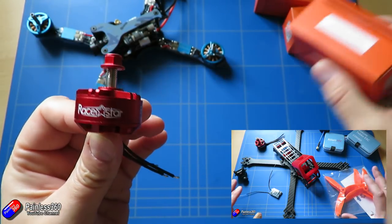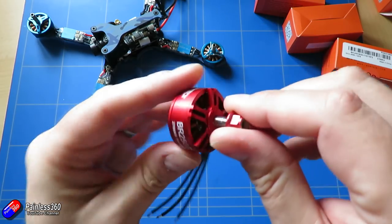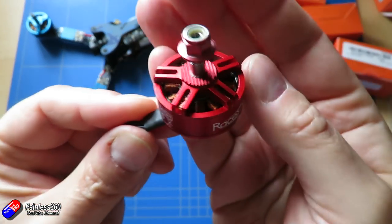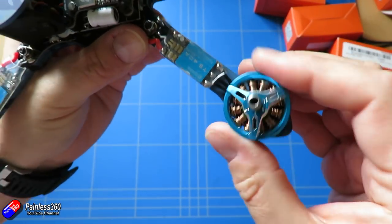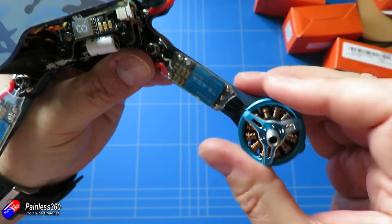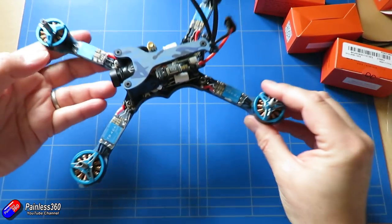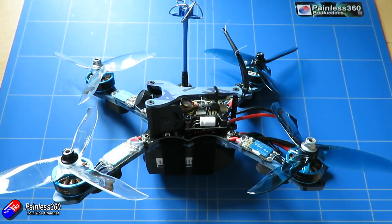A lot of these motors are very open, so be aware of that when flying in particularly gritty or crappy conditions. If you have a nasty crash, there's going to be an awful lot of debris getting inside your quadcopter. It's amazing how much grit in parks and playing fields is actually ferrous metal that's rusted to almost nothing — if you get that inside you're going to have to strip your motors and sort them out. That said, the motors work very well.